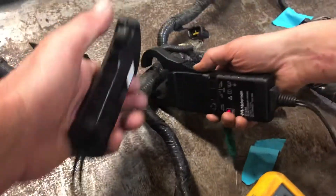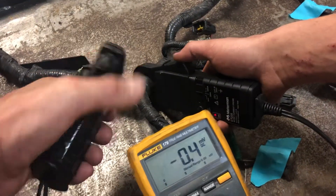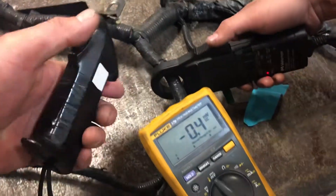Three amps — still kind of insignificant. You want to go in the middle there and see if you can isolate the middle? Okay, so in the middle — 60 amps. We know it's there but it wasn't here, so that makes it have to be down this branch here.